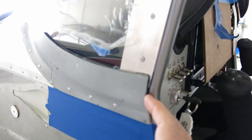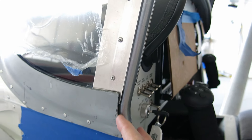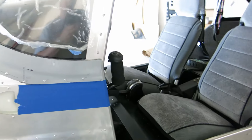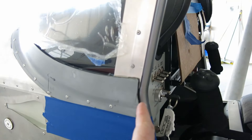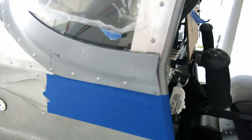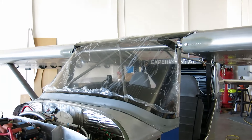On the ends here, I think we're going to fill that in. Probably go with what Derek commented — I saw it on his video — we'll just squeeze some out or mix up the 2216, let that sit for a couple of hours until it starts to harden, until it's almost like a paste or maybe a pro-seal consistency, and fill this in right here. Get that in there and on to cure. So that's the two things we're looking at today.